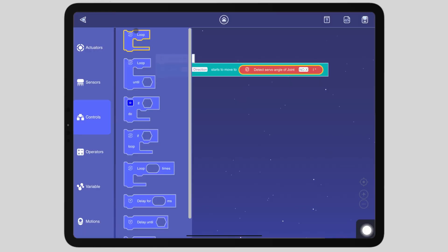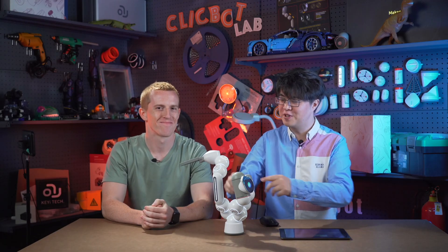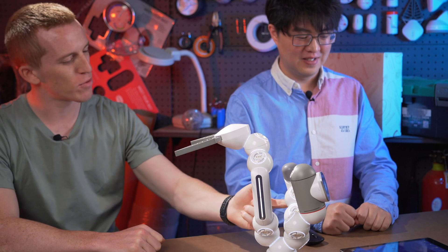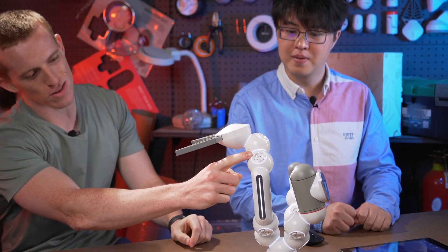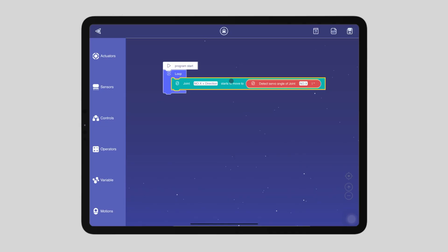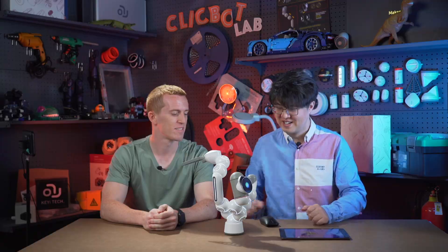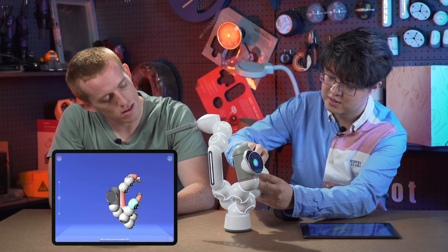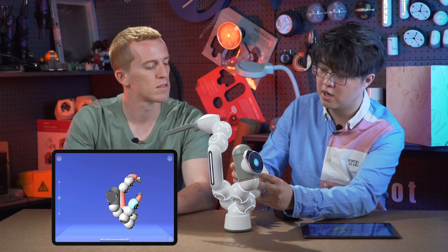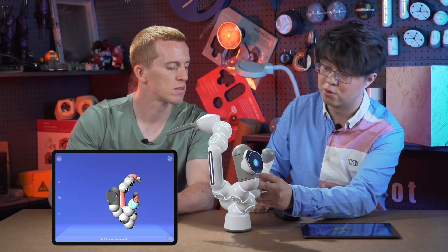Let's not forget a loop function here because we want to play for more than one time. So let's link the first group of joints together — starting with the one under the smart foot and pairing it with the one under the grasper. Let me detect the first joint, which is joint number 5. The current angle is 189. When I turn it clockwise, the value of the angle goes up. And when I turn it back, the value goes down. And accordingly, let's detect joint number 10. The current angle is 11. When I turn it clockwise, the value goes up. And when I turn it counterclockwise, backwards, the value goes down.